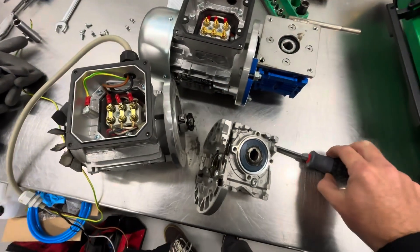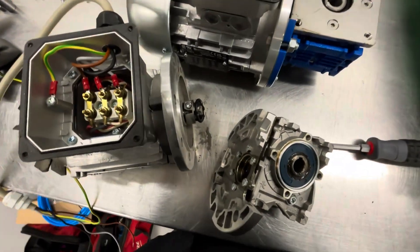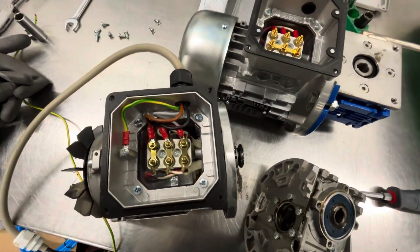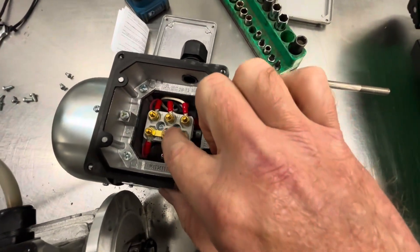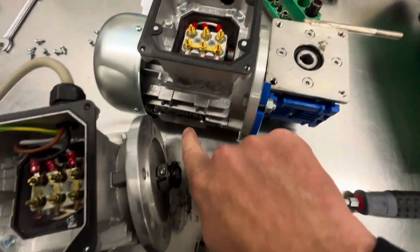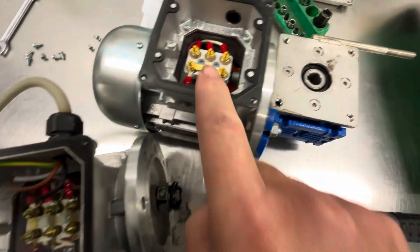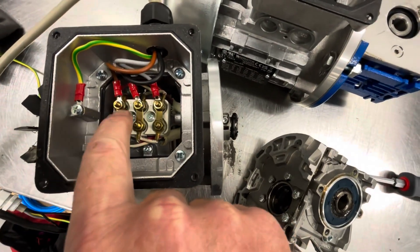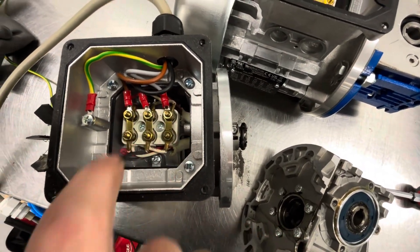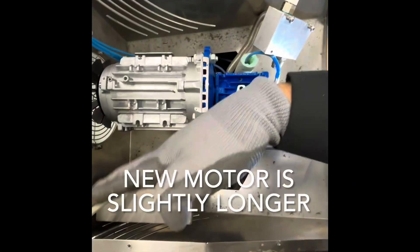I switched over the display and the bolts. Something worth knowing when switching a motor out: there's high voltage and low voltage wiring, and you've got to refer to the plate. If I had done it one way that would have been wrong — I need to go to the configuration with the little bars across. Now I've got the new motor and gearbox fitted.